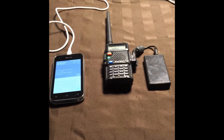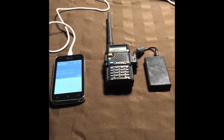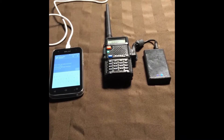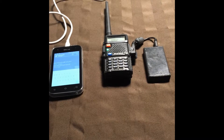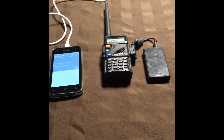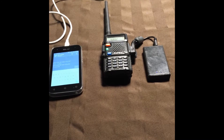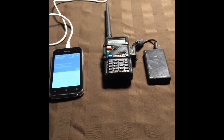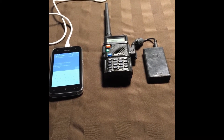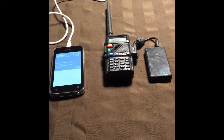I have had luck with the Baofeng in APRS with this particular setup. Sometimes I use my tablet instead of this cheap phone — it works a bit better. Obviously it has limitations: you have to be within range of hitting an igate to be really useful, which I just can't do from here. But it does work back and forth. My Kenwood D710 does digipeat, so I could set that up to act as a digital repeater for me.